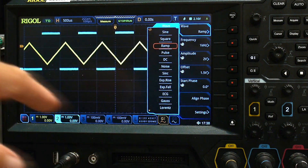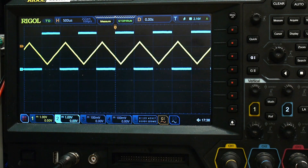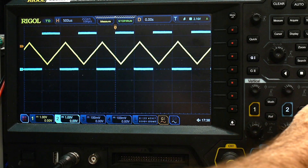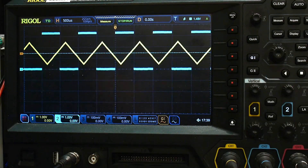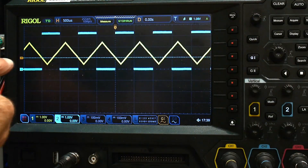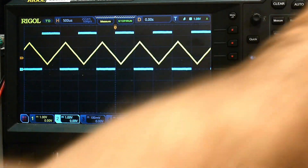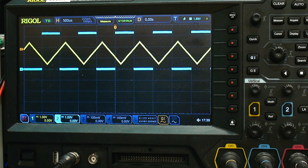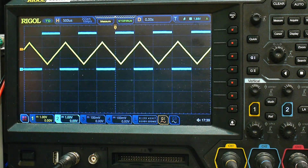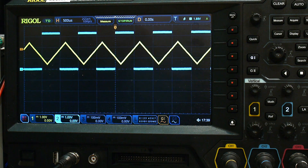But if you just want to do a real quick and dirty, I look at the trigger level. Trigger level right now is set to 2.16. If I go over to the trigger level knob, I get my trigger level, and I can use that. I can go right where it's crossing and just read the voltage — it says 1.08 volts. Or I can come up to about there and say, that's 1.88 volts. So without having to go into the menus and slow yourself down, you can just use the trigger level to do a quick measurement. There's the tip of the day.